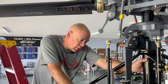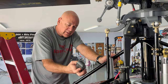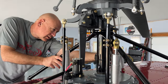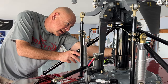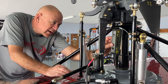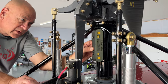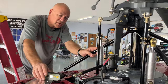And you level the helicopter right here. I use a digital protractor here, and I got it within 1/10 of a degree. Right now it's reading 89, actually it's 90, 89.990. It's flashing. Can you do it on the right side? I don't know. Let's try. Can you get that in there? I don't know. But anyway, okay, you can see it, 89.8. Good. That's probably me not holding it steady. So anyway, we're within 1/10 or 2/10 of a degree of vertical there on a digital scale.